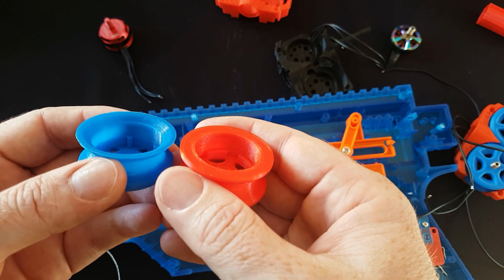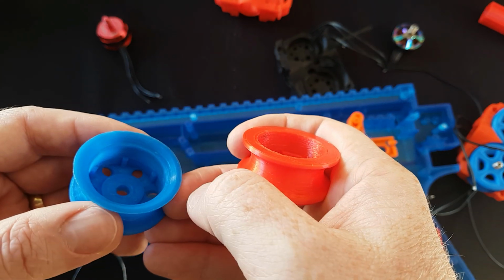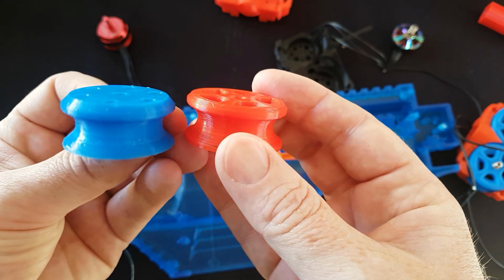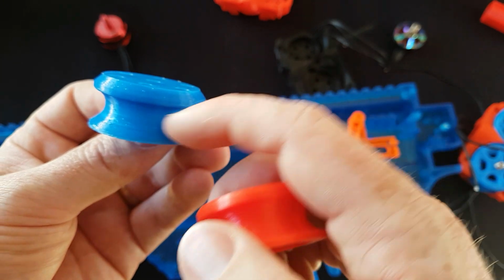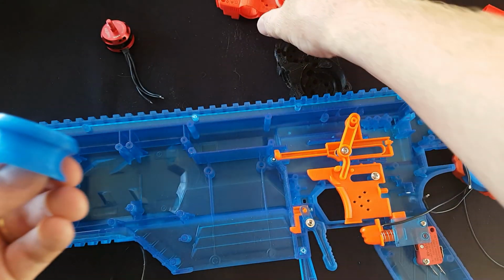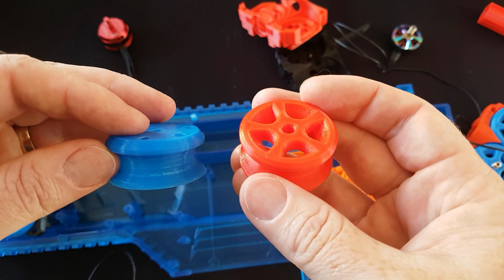And another thing, because of the recess, we've been able to change the bottom of the motor and the wheels. So the wheel can sit a lot flatter. It actually doesn't show very well on the video, but this angle and the size of that is much reduced, because on this one the motor had to sit so high that we had to offset it back to have the center of the motor, the center of the wheel, line up with the center of the cage. But now with the motor sitting so much lower, that size of that bulky top bit has been reduced.